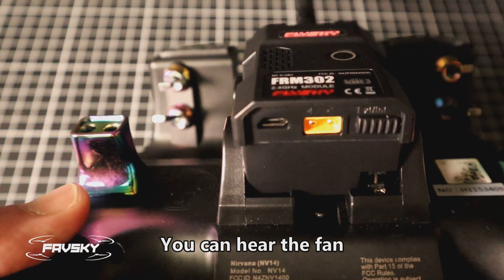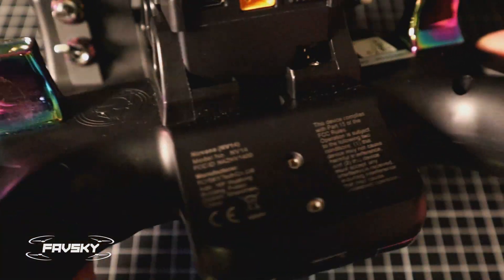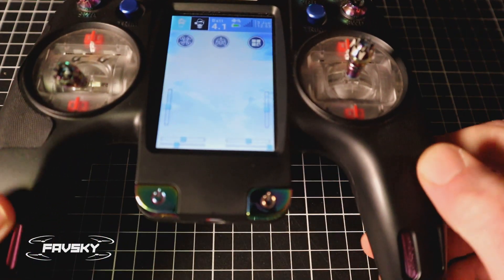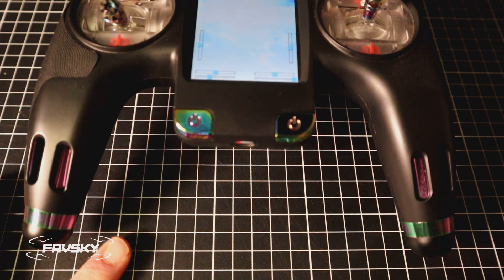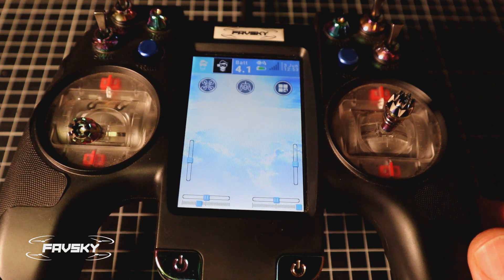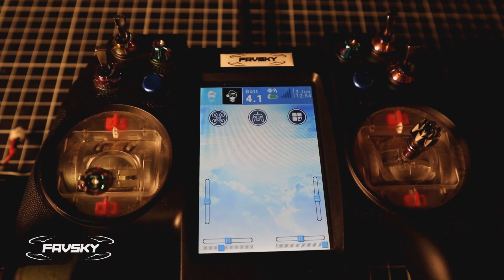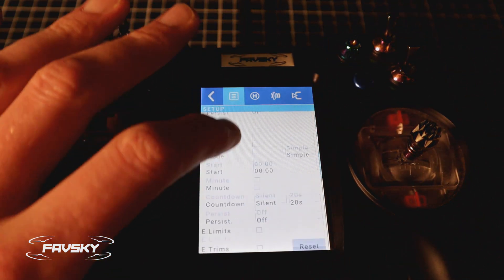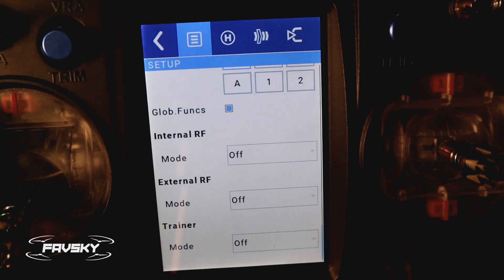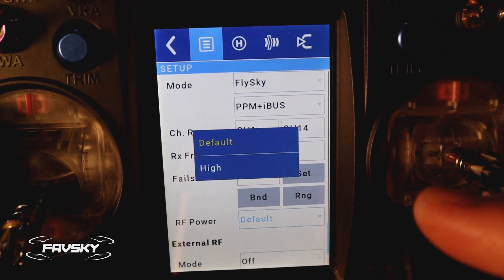Here she is up close — looks quite nice. You've got your USB, XT30 external power, and external power on/off switch. It sticks out quite a bit but it's very tight — that's not going anywhere. If I flip this it will hover above the surface so you can slide a finger under it. Let's look at how we connect this thing. I've rigged up a little battery connector to fire up the receiver. Jumping straight into the menu, I've set up a new model — internal module is off, internal RX is off. With internal RF flicked on to FlySky there's a new RF power mode: Default or High, from the May firmware release.